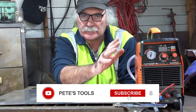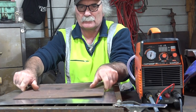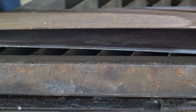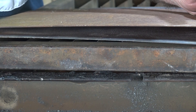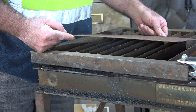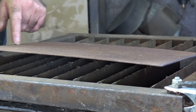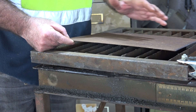Anyway guys, same as usual — if you like my videos, subscribe, drop me a like, drop me a comment, come say g'day in the comments below and let's get into it. So if we look at the difference between the two materials, you can see the stainless steel on the bottom and the normal sheet steel on the top. The sheet steel may be a little bit thicker than the stainless, but we'll cut both of them and you can tell me which one cuts better. This is only about two millimeters thick — it's still quite solid steel and you can still make a lot of stuff out of it. I'm going to try and do a squiggly pattern with the plasma cutter, then show you what the edge looks like, and then we'll do the same thing on stainless steel.